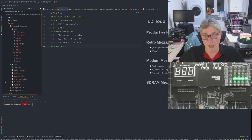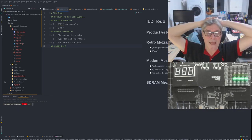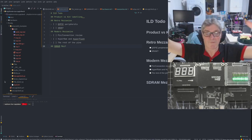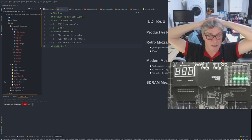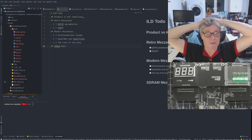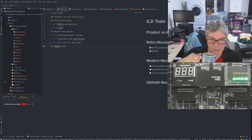With the SDRAM, I'm not sure what speed we could run it at. I don't think anyone on the MX has ever run the SDRAM beyond 100 megahertz. So performance wise, it's going to be very similar on average compared to the HyperRAM, but the pauses for the refresh, etc., will pose a lower penalty than you do having to go through the HyperFlash state machine. So there would be a marginal benefit, but half the capacity, I think, Laurie. That would be my executive summary.